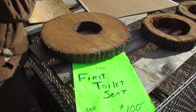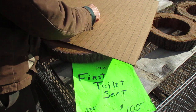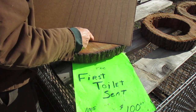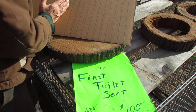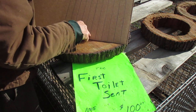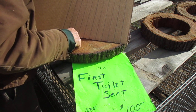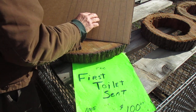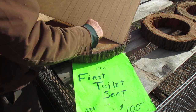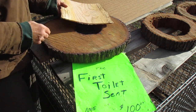Another thing - warping of boards and checking on the end of boards. Say this is a board right here with the grains running this way and it checks down the center. Once again this edge here is drying pulling it this way, this edge here is drying pulling it that way, and it's going to give up its strength in the place it's weakest - which is down the center. So I think if you were to paint a foot of the log and into a certain part here, three inches or whatever on the end of the side, you'd find a lot less checking. Also when you sticker, if you put the stickers out the furthest, I noticed that works a little bit better too.